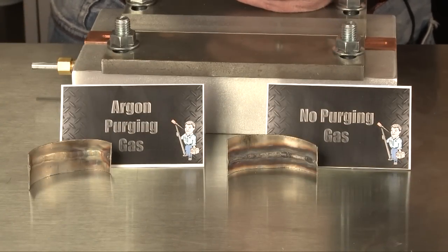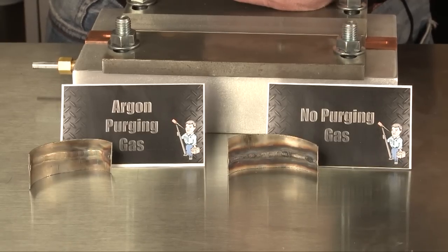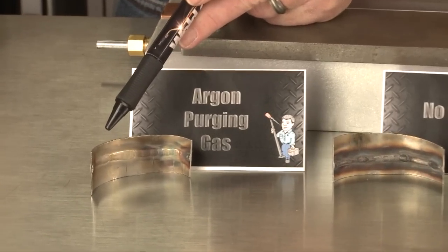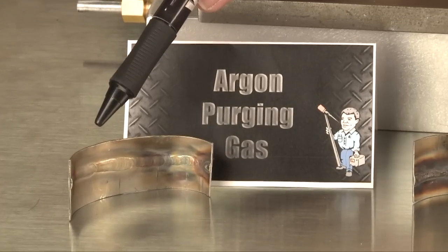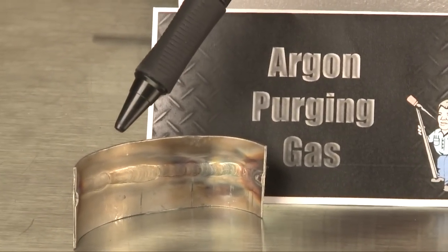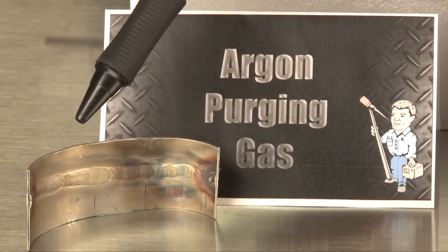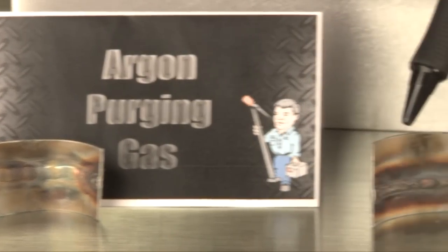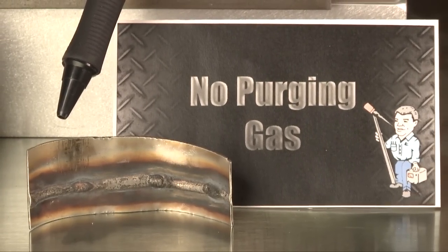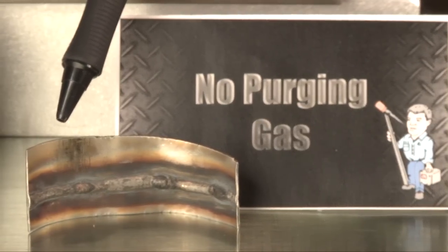By the wonders of TV magic, we took a cross-section out of our stainless tubing and cut it in half. Now you have in front of you a sample of a part that was purged properly with argon purging gas. You can see that the penetration looks just like the weld on the outside — it wetted out very nicely, had really good control of the puddle. If you look at this other sample, you can tell that I had turned off the gas and we have oxides — those are chromium oxides and they'll cause some difficulty. They will cause premature cracking and the service of your part won't last quite as long.